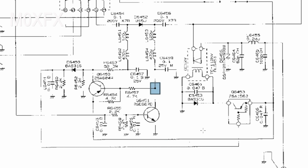That capacitor being tacked on there, we've actually already got a capacitor here. Now, the effect this will have is just to increase the capacitance at this point. So what we need to understand is what this capacitor is doing. Well, because we're actually switching in and out a diode, we're using these two chokes, and it's just to choke off the RF and try and keep it from coming down into the circuit.